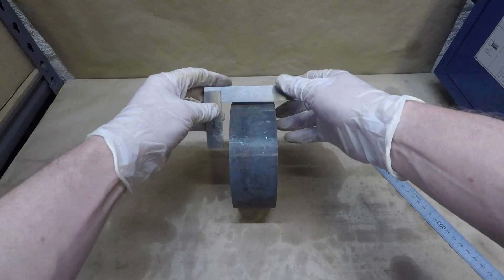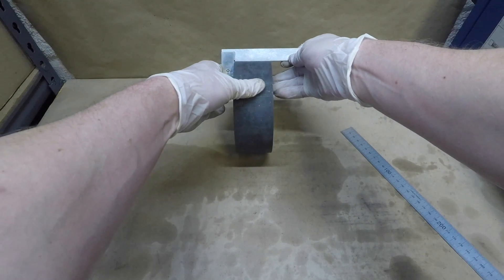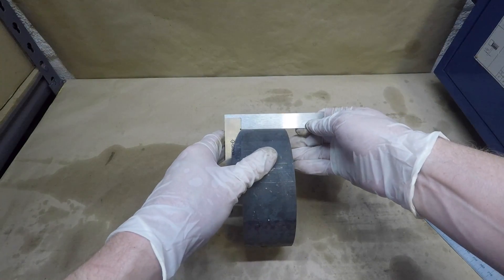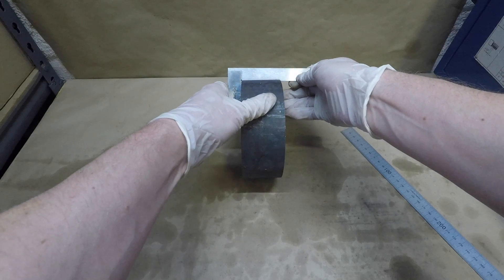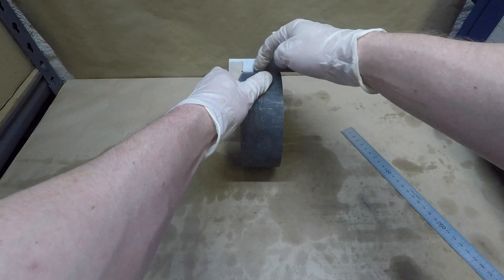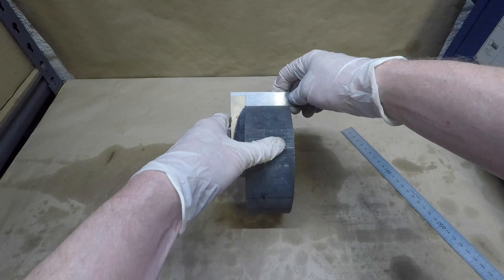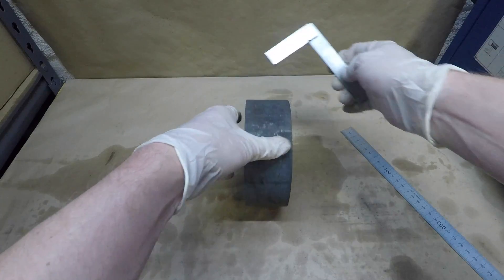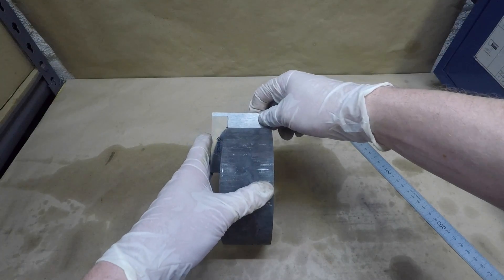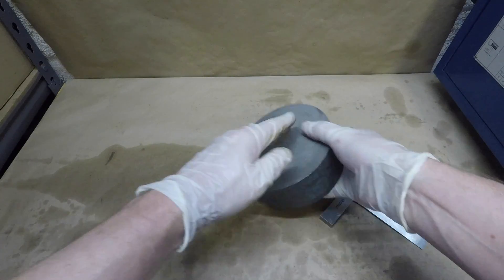What I'm doing now is checking which side of the workpiece is the flattest, because that's obviously the side I want against the chuck to start off with. With it being flat against the chuck jaws it will hold better, but also it allows me to clean up one edge the best. It's twofold — it gives me the best mounting and also lets me clean up the front face.